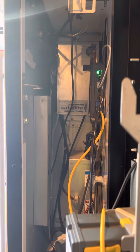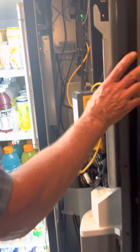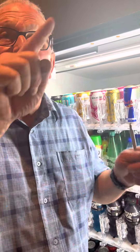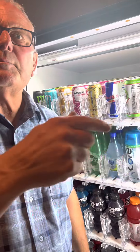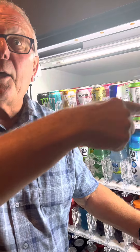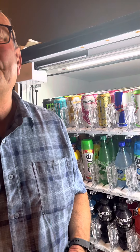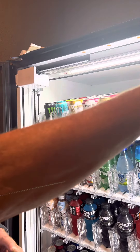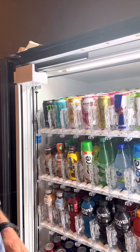That's why if somebody calls me saying they have a homing problem, I'll have them go right there and say: is your yellow light on, is your green light on? You know right away it's at home, provided they go through the steps. I'll have them go there over the phone and say is your yellow light on — no, well then it's not at home. If you don't see the yellow light, the control board doesn't know it's at home.